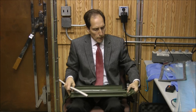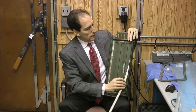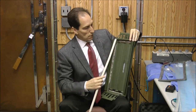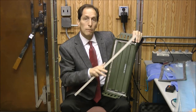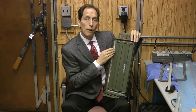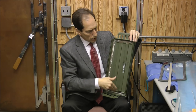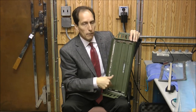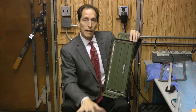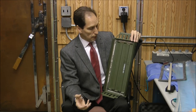What you have to do is take the gasket and cut it into four pieces — basically a left side, a right side, a top, and a bottom — and butt them up against each other. You'll get a nice good seal all the way around. That gives you a conductive seam right around the outside. You then take the lid, lay it on top of the can, and seal it up normally, and you'll get a nice tight RF seal.